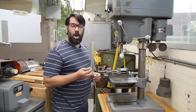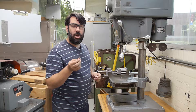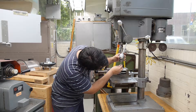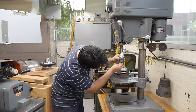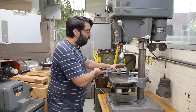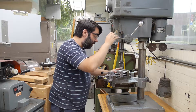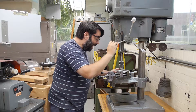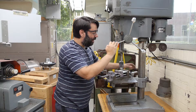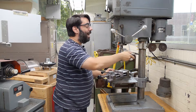Next, let's talk about loading the drills. As we learned with the lathes and the mills, we're typically going to start with a center drill for the best locational accuracy possible. We grab the center drill, open the keyless chuck, insert the drill, and clamp it as securely as possible by hand. Next, we move the workpiece underneath the drill, locating our target position where we wish to drill the hole. And once we find it, we can tighten the vise clamp as shown in the previous step. At this point, the part is clamped securely, we have the center drill loaded, and we're ready to commence with the actual drilling activity.